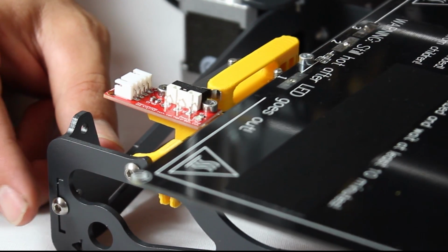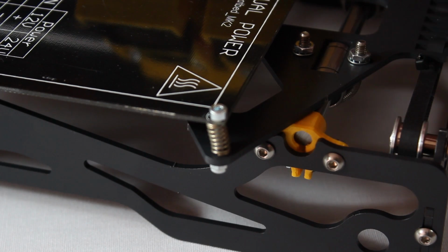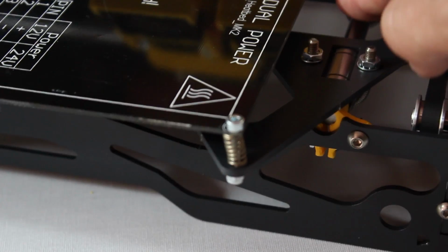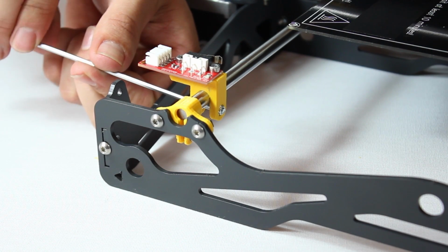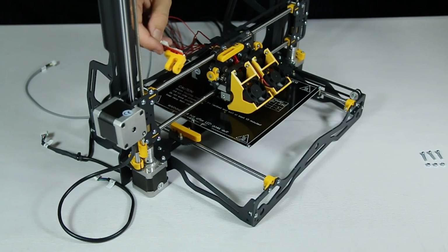The end stop mustn't be all the way up against the printed part on the tip of the y-axis, as the linear bearing on the other side may strike the axis tip. Test to make sure this doesn't happen. If you are happy with the result, apply the screw. Don't tighten too hard or you may damage the piece.